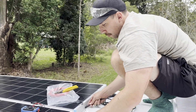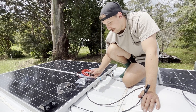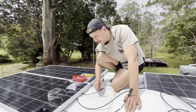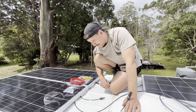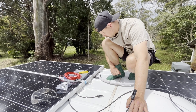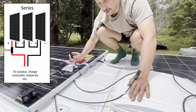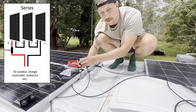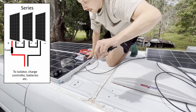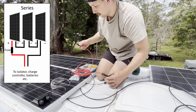Even though I've connected some cables, I haven't connected all the panels yet so there's no live circuit. After much more effort than anticipated I've got the positive cable from this panel routed under and over the rib and out. Tip: if you want to lay cables a specific way under the panels, put them down before you screw the panels down. So these are wired positive-to-negative through the series string, with the negative going through the gland. I'm leaving the final positive and negative ends apart so I don't create a live circuit with 60-something volts in it.